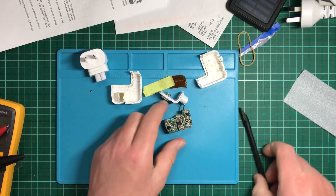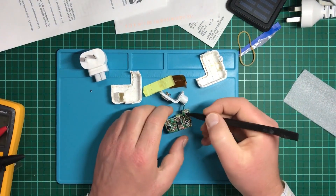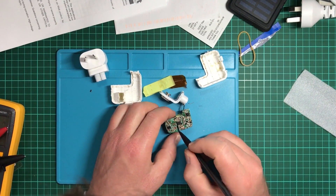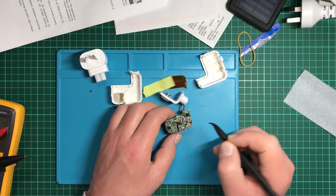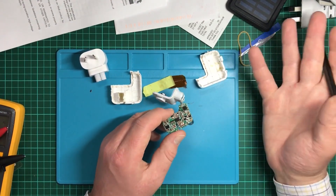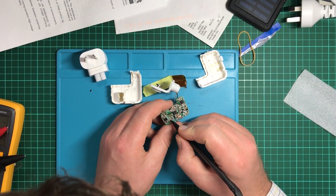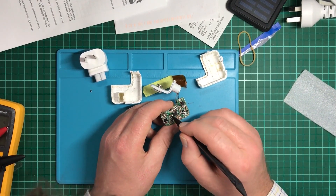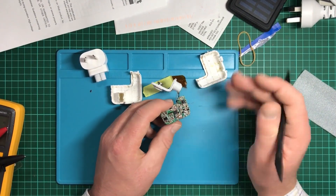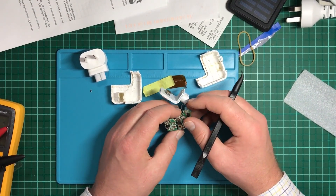You've got these four resistors here. If you've looked up any sort of DIY power supply for an iPhone or iDevice, it stipulates you need four resistors that attach onto the data lines. It would have been nice if you could just hook up positive and negative to make your own secure charger, but in this case you have to have these four resistors hooked up to the data plus and minus lines — otherwise for some reason the phone won't charge. I haven't played with it myself, although I should probably do it since I've got a phone I can play around with.